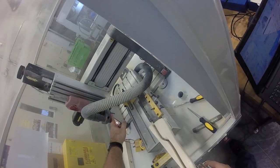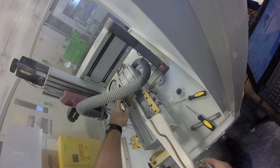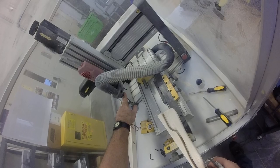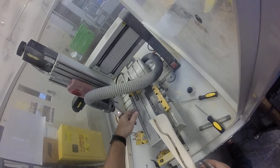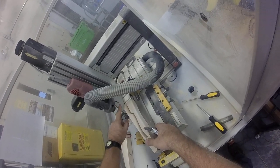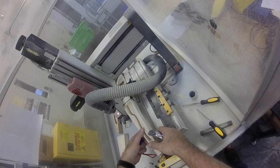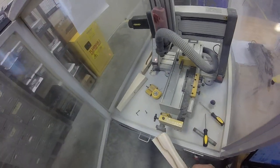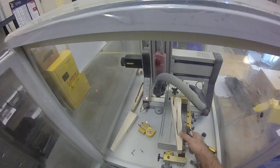And our Z, we actually moved the tool out a little bit because this was coming very close to this. We extended the tool out 1.25 inches. Now we have plenty of room, and also we have plenty of room to clear the part. So we have the best of both worlds right now.